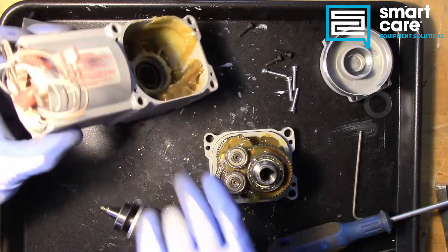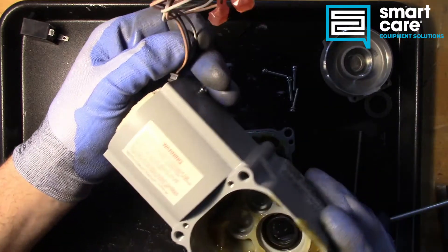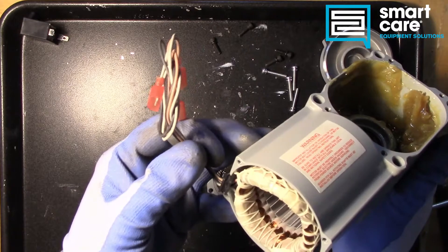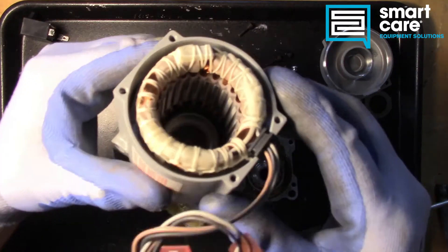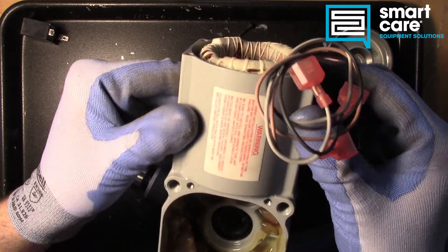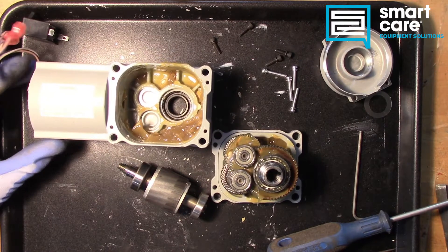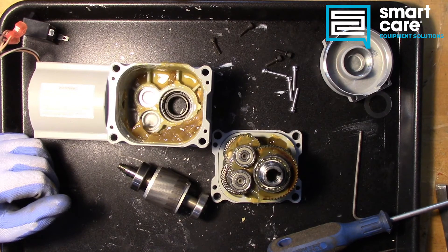Notice, though, there is not any kind of position sensing. There's no encoders in here, no switches or any kind of movement control. All we've got are the windings of the motor. Interesting setup. Not sure what I'm going to do with this — this might be a neat cutaway to demonstrate how this all works.